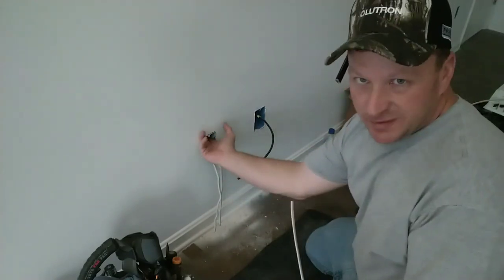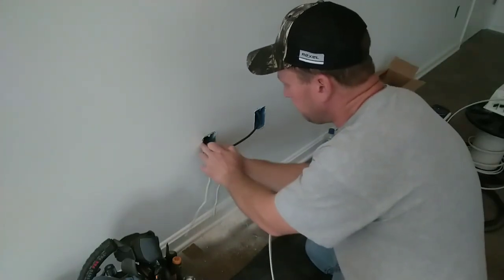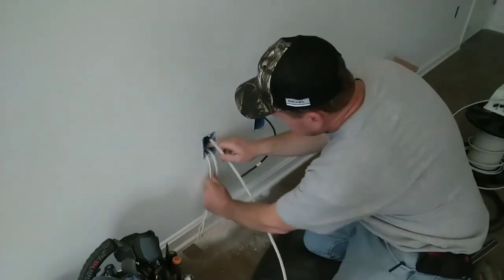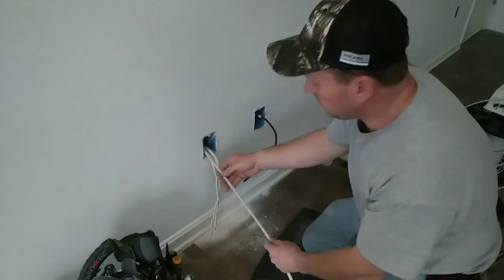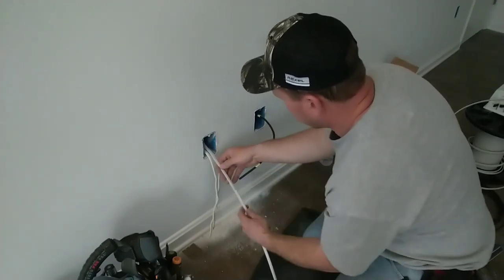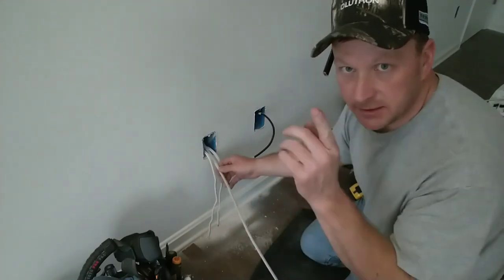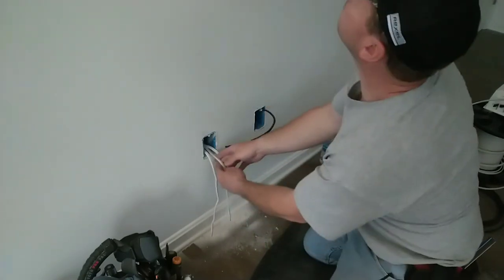I'm going through this nylon's knockout on the top side. So you get a pair of needle nose or screwdriver on this top corner, punch it out, make sure it's out of the way. And as you guide this up the wall, keep it as straight as possible so that it appears at the top of the hole. If this is an insulated wall, this is going to be very difficult for you, almost impossible. This is not insulated, shouldn't be an issue. And you may have to do it in a back and forth motion to feed this up. Now if this doesn't work, we'll use fish sticks. I'll show you how to do that if we run into that issue. Let's see if I got lucky.